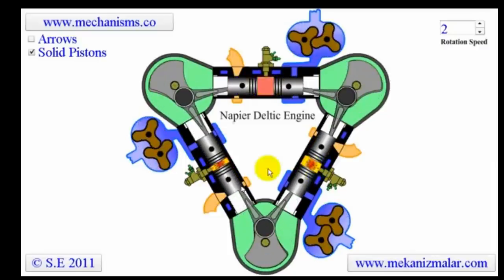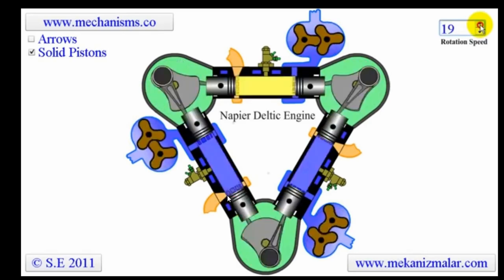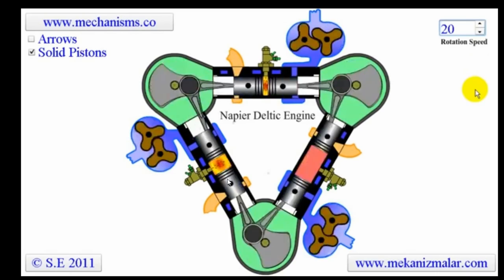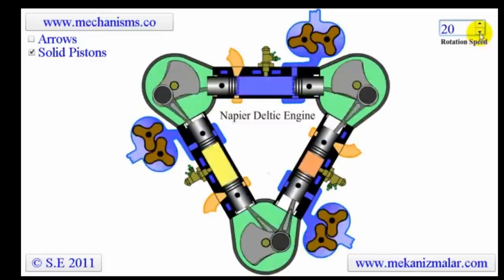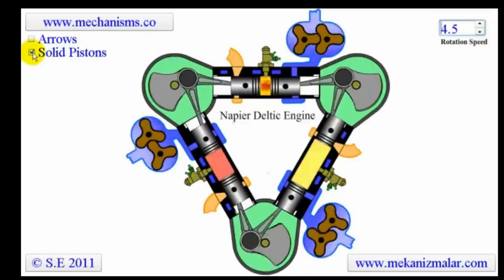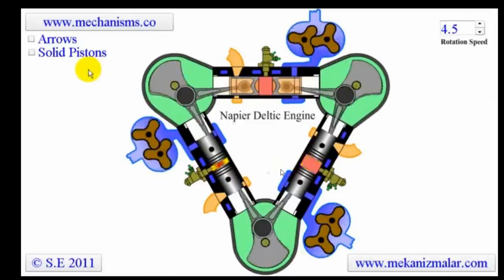So your exhaust ports have to open early, or you have to have pressure equal from your supercharger by the time you get to your exhaust ports. It's a balancing act, and it varies with revs and internal temperatures, how efficiently you're burning, and so on and so forth. So in this configuration, it isn't the best throttling engine ever. You kind of want this to be like an APU or maybe a ship engine, which is what they use for trains, where you start the thing going and you keep it there, because your port geometry and your pressures are dependent on that.